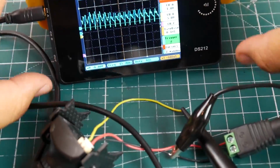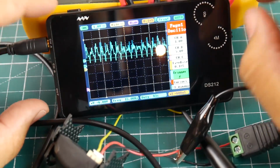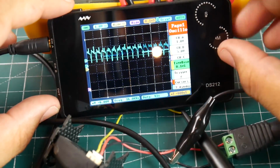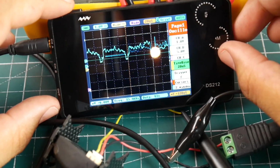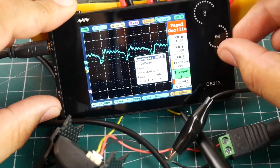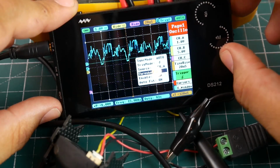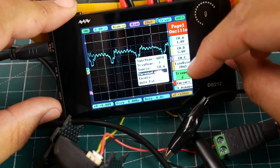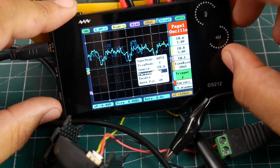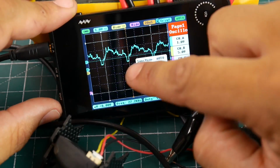We'll see right now. All right, let's just bring it back. Okay, so now we're on this screen. What we want to do is decrease the time a little bit. Then let's go to the trigger here, and we're going to play with the threshold. Now your threshold may vary. Your signal might be going just crazy here. So set it to 20 milliseconds, which is pretty good because it's roughly within every half a frame.